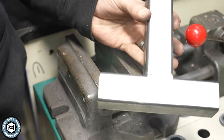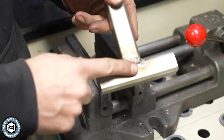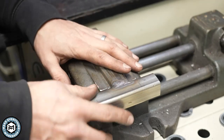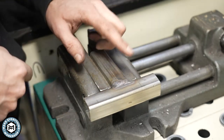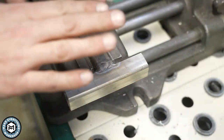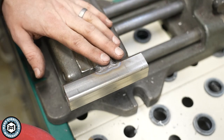This piece being mild steel, it's less likely you'd want to go with a mirror polish because even though it's got a semi mirror polish on it, it's still going to rust. This is stainless. The idea of polished stainless is extremely common and something you may be asked to do. One of the things that comes up in my work a lot is repair and restoration work — someone has a polished piece and wants me to repolish it. This is just some welded one inch by 120 wall stainless. I'm going to grind out these welds, bring this up to polish, and show you how easy it is even on something tougher like stainless steel. The process is going to be the same — I'll start with a 120 grit because these welds are a lot lower, bring it up with surface conditioning, and then polish it.